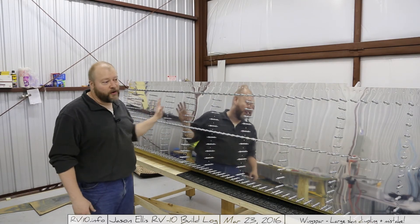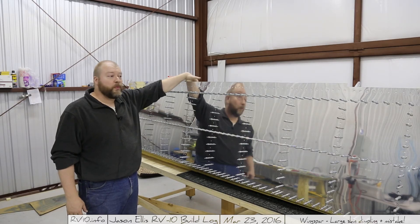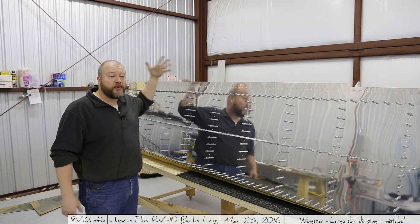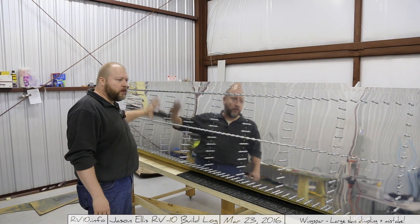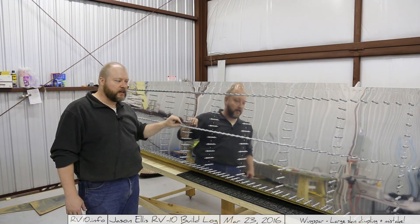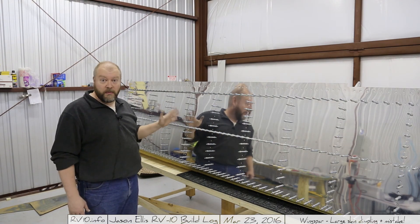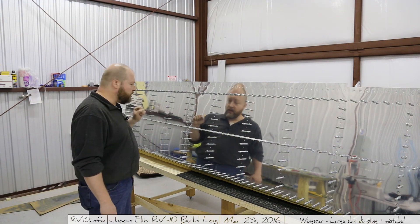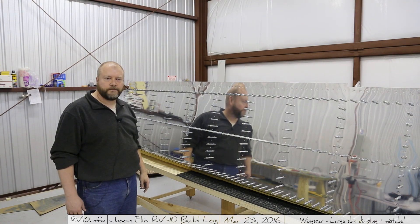It's finally time to go ahead and start riveting on this skin. I did go through and put all the rivets in on the rear spar — the step I had forgotten — went through and did it all, took a couple of hours. Then I put all the skins on and got all the Clecos on. I want the skin good and tight, so I made sure I had a Cleco in every other hole. Used up a lot of Clecos — remember, you need a lot of these things. Wings take up a lot because there are a lot of holes. That's what's coming up in the next video. See you guys later.